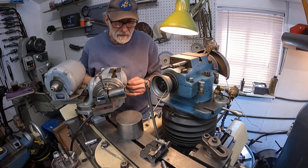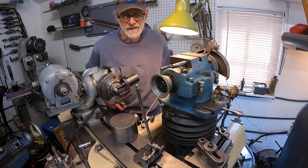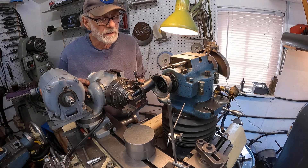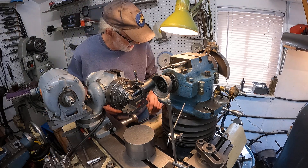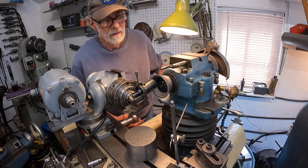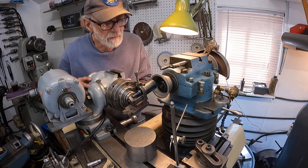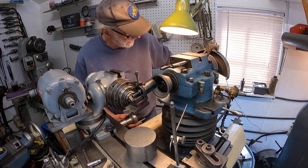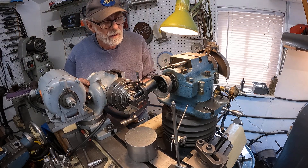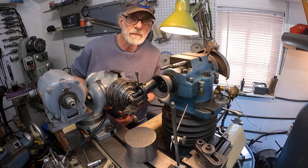I'm going to put it just like that. I'm going to swing this over, crank the table away. Looks like we're good. Now I can grind this upside down and it's sometimes easier, but I'm going to grind it like this. I had quite a bit of angle on that — I'm going to reduce it. I think this doesn't need to be that much. Maybe about 7 degrees or something. There we go — I'm going to call that good.